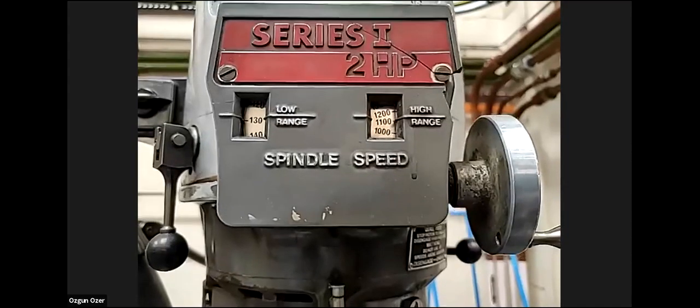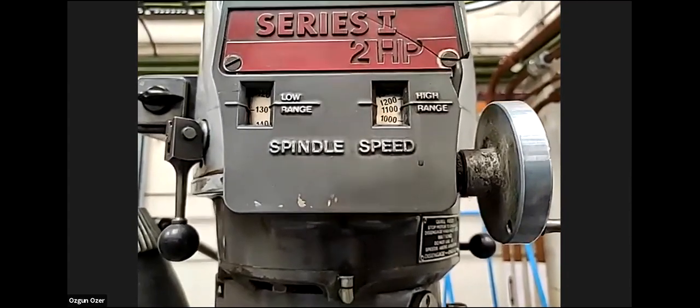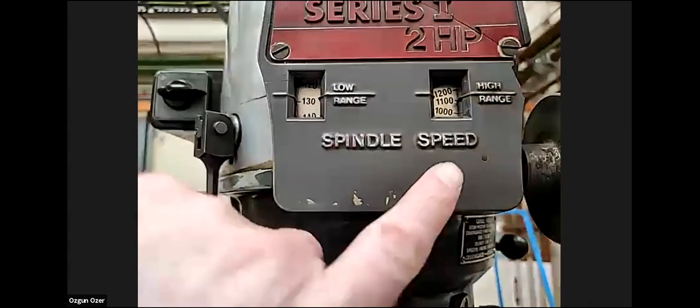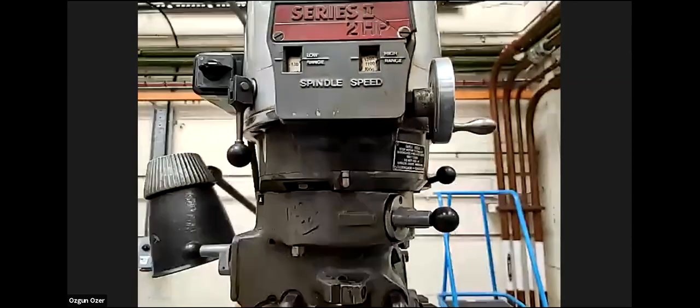So what is the spindle speed, Alan, for drilling? The spindle speed is slightly faster, 1100 RPM. Again, this is in the technical catalog. So I can give a task to Abizar and Furkan.